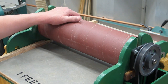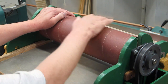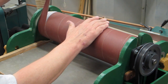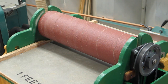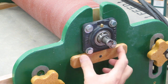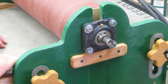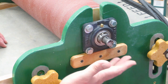Now we have the drum finished, the bearings in place, and the hook and loop Velcro material taped and wrapped onto the drum. It's very easy to peel off and wrap a replacement sheet or a different grit — it only takes about a minute. I put wood blocks under the flange bearing on both sides as locators, so if I have to take the drum off, when I put it back I know it's at the same elevation as when I trued the table to the drum. If needed, I can always put shim stock under the flange bearing to adjust that height.